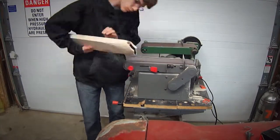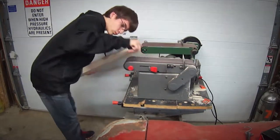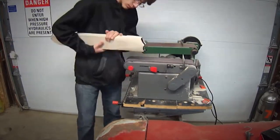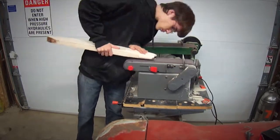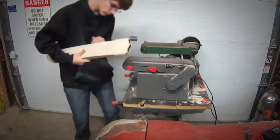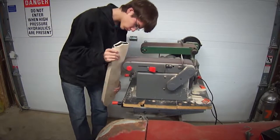The wheel underneath the belt sander — if you are doing large areas and just put your piece of wood flat on the sander, the wheel lower down where you're holding the wood will actually create a divot. So keep an eye out for that. Also, make sure not to stay in one spot too long when doing large areas — move it around a lot so there are no low spots or divots.